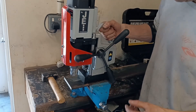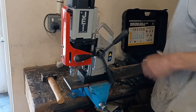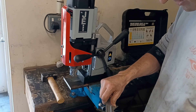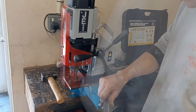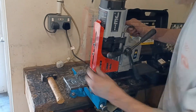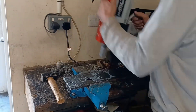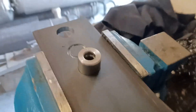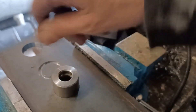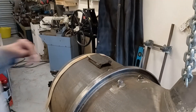I just want to test this — it's 31mm. I've got two drills, one's 31mm and the other's 32mm, and this is inch and a quarter. Look at the fit — I've got a tiny bit of play, could be microscopically a bit tighter, but it's really not bad at all. I'm definitely going to go with that.